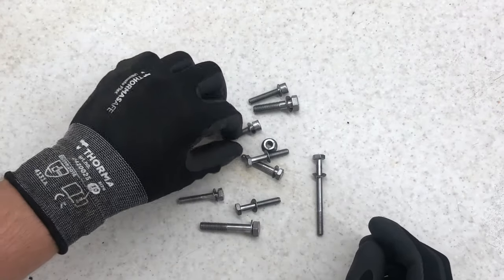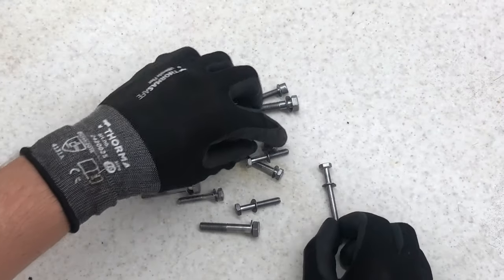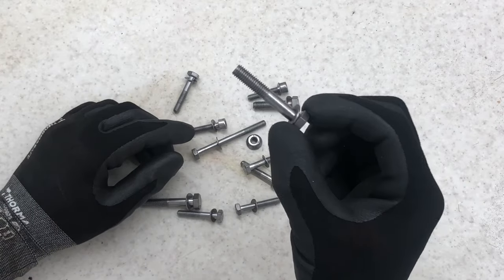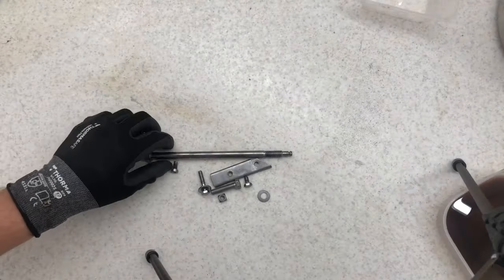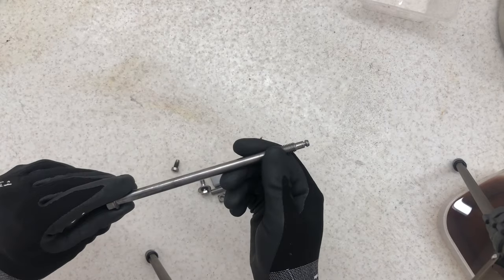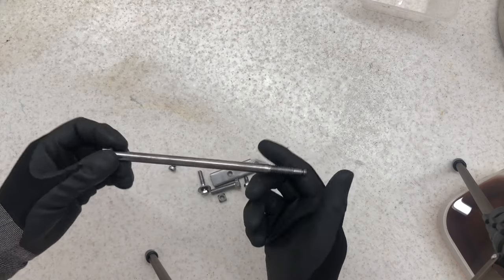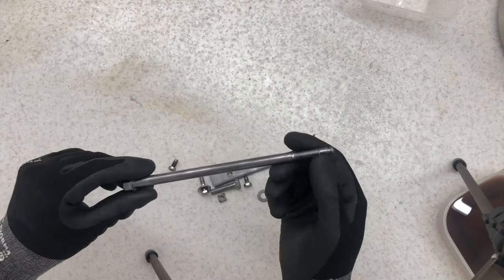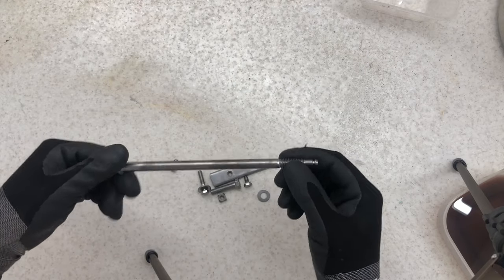On this one there's quite a good range of bolts — some cap heads, some hex heads, some nuts, different length shanks, different size threads — so that'll be quite a good one to see when it's all plated. This last one gave me a bit of a struggle because the black etching was pretty hard to take off. Most of it came off in the acid, then I chucked it in the sand blaster and gave it a blast, then a quick wire wheel and it looks pretty good.